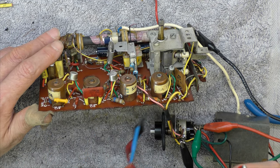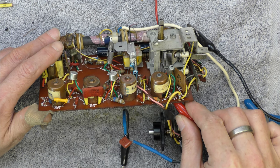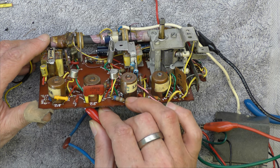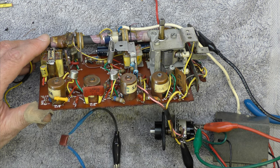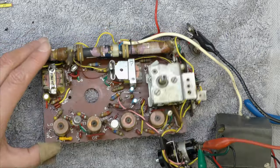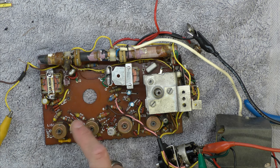I've injected the 470 kHz signal into the point marked for alignment, putting quite a signal in at negative 7, admittedly across the ferrite rod, but at least it shows some demodulation is going on. I could inject at other points to see if it's louder, though the danger is I'm being shunted by the ferrite rod. Injecting directly onto the converter transistor base, the first IF responds — nice and loud. But the second IF base gives absolutely nothing. That's interesting — the signal must be forcing its way through somewhere, but that transistor base isn't sensitive at all.